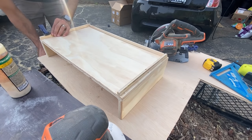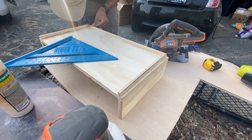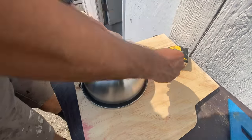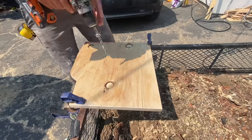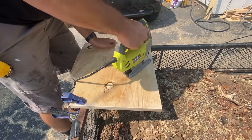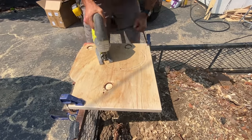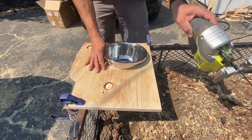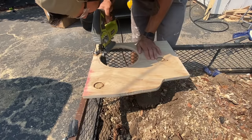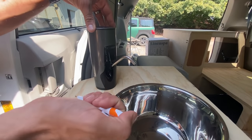Once the stage was done, I added a small railing around the outside to retain the fridge and hold it in so it couldn't slide off, then used a really fancy clamping system to hold it in place. I moved on to the countertop next. After tracing the contour of the van door onto the countertop, I traced the bowl that's going to make up the sink and cut out the circle with a jigsaw. I cut out that circle so it was just a little bit snug in order to hold the sink in with a tension fit, so the sink wouldn't rattle around or make any noise but would still be easily removable if and when the owner wants to dump water outside.